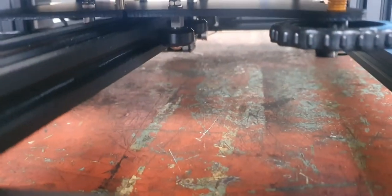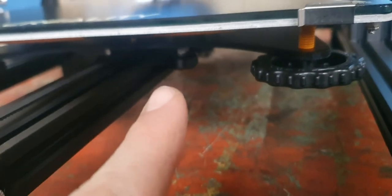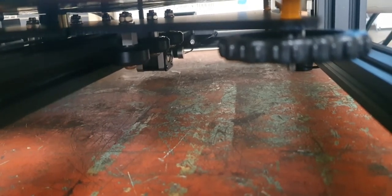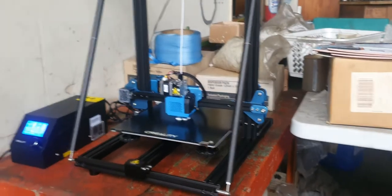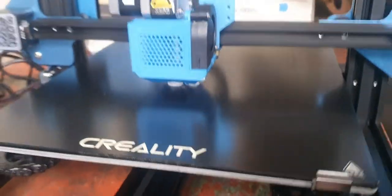Probably should have checked all the wheels to see if they weren't over-tightened. But you know what, who gives a damn, because you can get a bag of 20 wheels for like 10 dollars. They're so easy to change - you see that nut up the top and there's a bolt, you undo it, take the wheel off, put a new one on. The wheels come with bearings in them. You can change all those wheels in like 10 minutes - just flip the printer on its side. Parts for these 3D printers are so cheap.